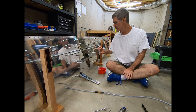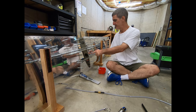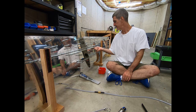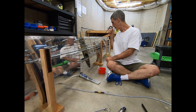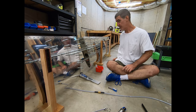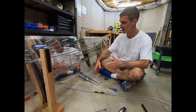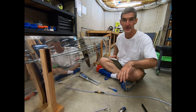Riveting the last panel — I'm doing the rivets on the end spar ribs up to the stringers. Most of these are straightforward, but some of them get really kind of painfully tight up under because the stringers get in the way up here. Over here, no big deal — easy to get at. Bucking most of them, using the squeezer on the ones I can get at. This is a perfect time to use the hand squeezer because it's just a few. I've already got it set up, it's easy to tweak, no need to hook up the pneumatic.